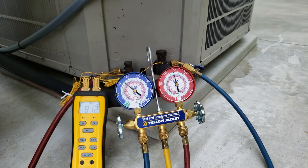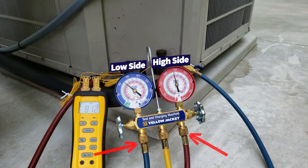First up, our oldest style is really a three-port manifold, referred to as a manifold gauge set with hoses. There are three ports on the bottom: you have a low-pressure side gauge, a high-pressure side gauge, and the high-pressure side connects right over to its port. Even with these handles closed, the low-side gauge connects to the low-side port, and then you have your service port in the middle.